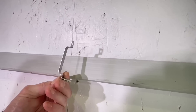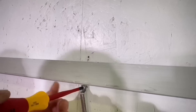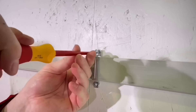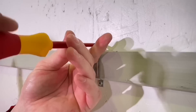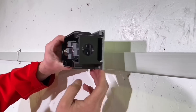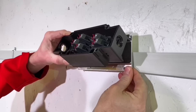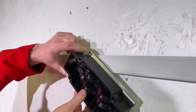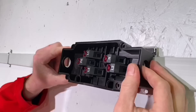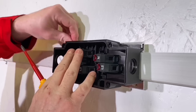I'm going to fix the flat cable to the structure of the building using these clips. They have no polarity — no angled groove or straight edge — so it doesn't matter which way around they go. These are steel clips, suitable for any premature collapse requirements, along with the appropriate fixing. You can see we're fixing to a wooden surface here. The fixings are in place. Next we're going to fit the branching box. If this were an existing cable installation, you may have to remove a few clips to fit this behind the flat cable.